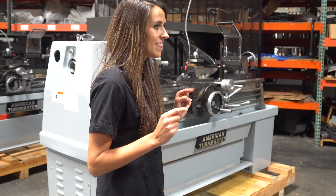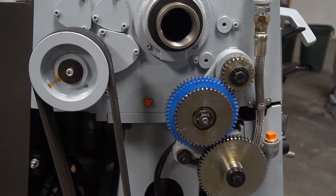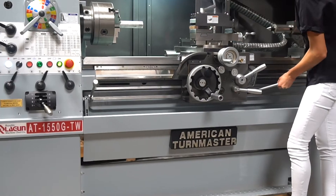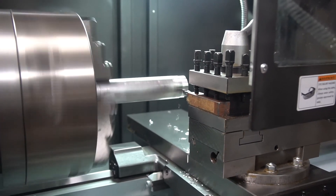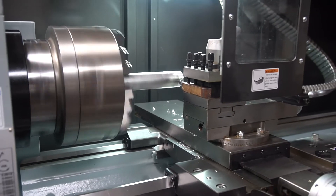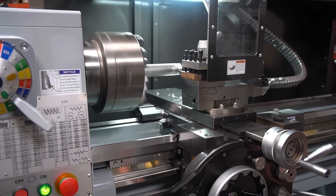What really makes this machine so unique is that it comes with a disc clutch in the headstock. The advantages: one, it can start or stop the spindle without starting or stopping the main motor. This helps control the starting speed of the spindle, which is very important when you have an unevenly distributed part on the chuck or a very heavy part. This also adds to motor longevity.